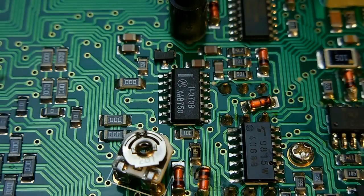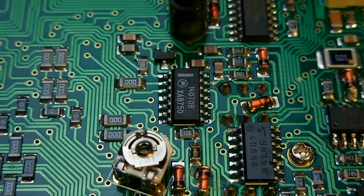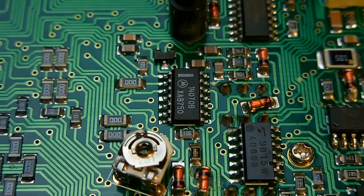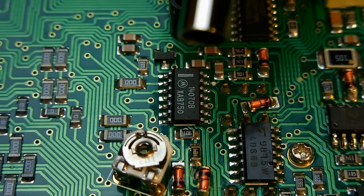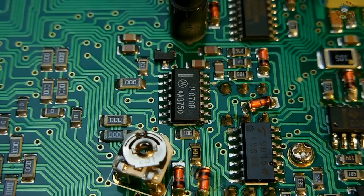We're now going to be swapping out this 14070B IC — that's a CMOS SSI Quad Exclusive OR and NOR gate. Many circuit boards use silver-bearing solder, and as a result you will require higher temperatures to melt the solder. I'm going to set mine at 325 on the rework station, and the dial is going to be positioned at number four. This is the smallest tip I have, and I'm going to heat up that integrated circuit, remove it, and pop in a new one. Let me power up the rework station and desolder that IC.